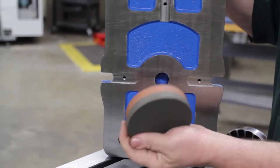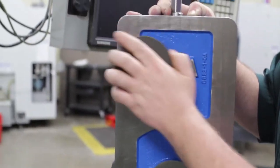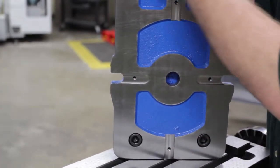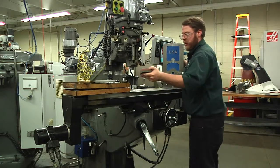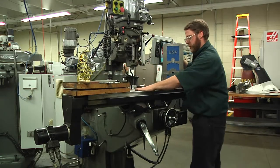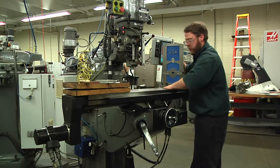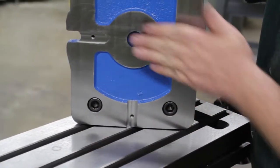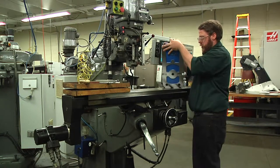Use both the coarse and the fine stone. The best way to be precise in a machine shop is to be very clean and make sure your setup is free of defects. So once again I'm going over it with my hand just to make sure there are no defects. I'm going to go over the bottom of the vise with my hand and make sure it's clean and free of defects. Then I'm going to put the vise flat down on the table.